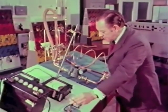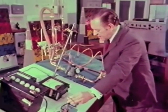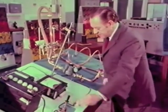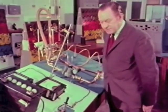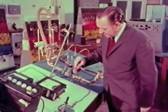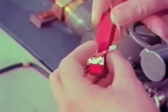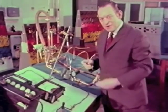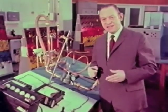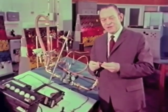You see it does bow out like the water pipe. I mustn't leave the current on for too long each time, otherwise I shall burn out the tape — it takes about 20 amps to do this. Now I'm going to try something different: I'm going to hold a bar magnet alongside, and this time when I switch on, something very different occurs. And of course there's no equivalent of this in the water circuit.